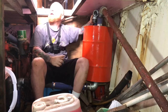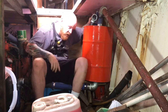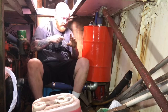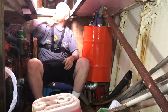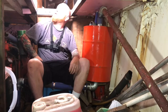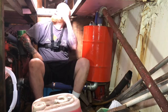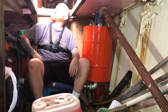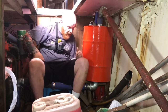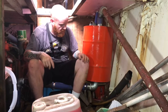When you turn that valve, it opens up an actual check valve that'll release something. There's gonna be a hole, a little hole. Really? Yeah, I'm pretty sure that's the way it's designed. That valve goes into a casing that has like a drip at the bottom. When you open that thing, it doesn't control the water flow. It just opens up a check valve that'll release the fluid out of it, so you can purge your system. That's what they're for, because it's a big system to try to get air out of. I'm pretty sure that's the way it was when we built it, or it was designed like that. I didn't notice. Just by the way that they're designed, it looks like a big check valve that'll release the fluid or the pressure or the air, to bleed the system.